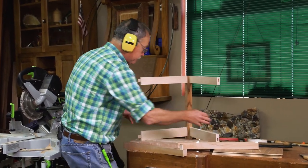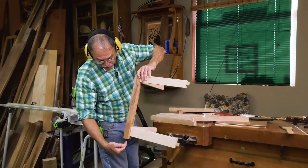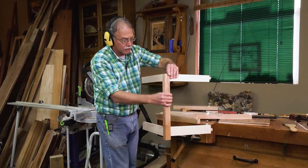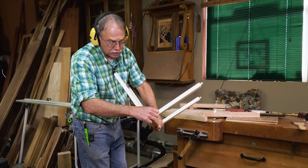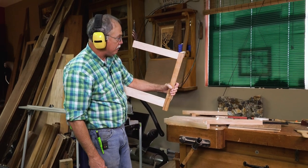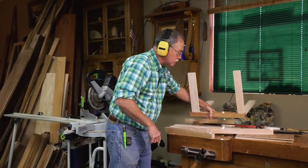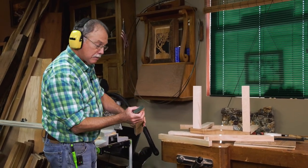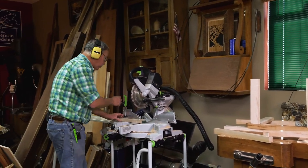Here's the assembly — there's a leg, looks good. Notice how this is up a bit — that's going to get a graceful arch right there on all four at the bottom. This is the bottom, this is the top. Also notice how these are inset, so there's no sharp shoulder in the middle — that's so the pillow can sit in there to the ottoman top. What I need to do next is cut these eight work pieces down to the finished length, then I'll show you how to cut the dominoes. Make sure you get everything square and to the proper length — all of these are 14 inches long. I like to use the hold-down as I make these cuts; it's more accurate.